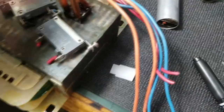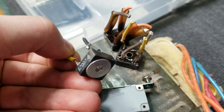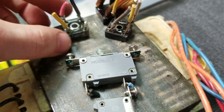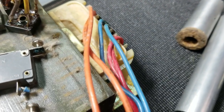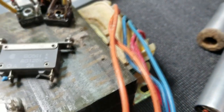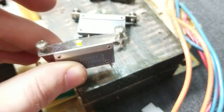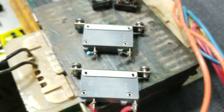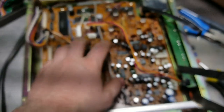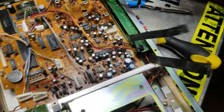So far I got three tiny little full bridge rectifiers. This one is special - it has a heat sink at the back. There's a number so we can figure out how many amps it can take. I also got these two little resettable fuses - two amps each. They're external too, so you mount them on the back of your panel, and if it trips it pops out and you push the button to reset it. Really cool.